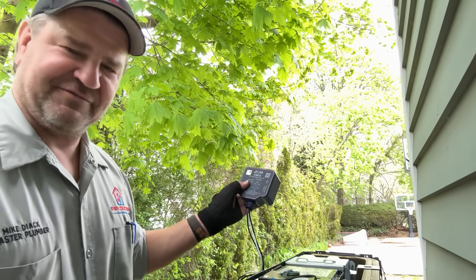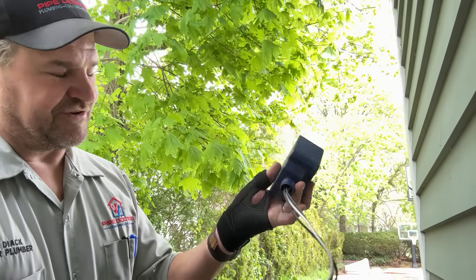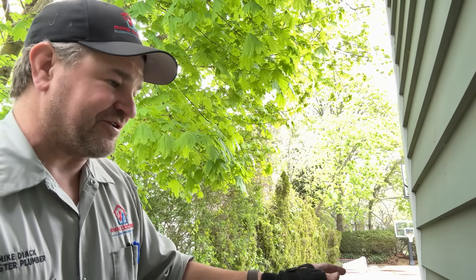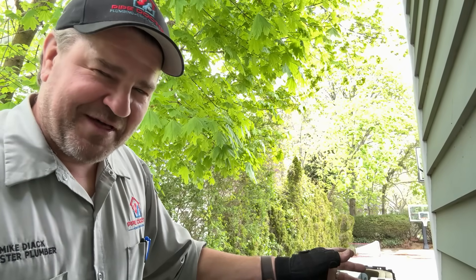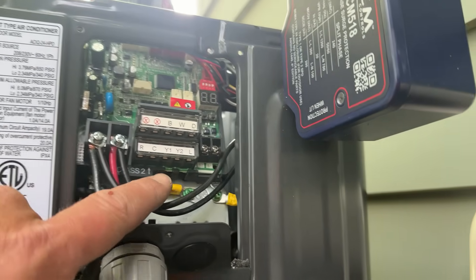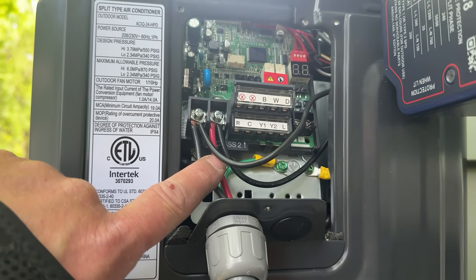When you compare the ICM to the Rector Seal, this is like five times the dimensional size, so I happen to like it. It does have a larger three-quarter inch opening for the electrical connection — put the nuts and washers in. Other than that, it's phenomenal. I've had one die because it got hit with a power surge, and it saved a two-stage Carrier Infinity communicating condensing unit we had installed about a year before that. The customer's complaint was no cooling — they had no idea they had a surge. So I'm hooking up L1, L2, and ground, with L1 and L2 coming from my disconnect. Line voltage is done — two black leads from the surge protector going to L1 and L2, grounds on the ground bar.